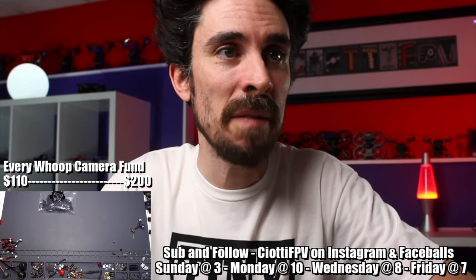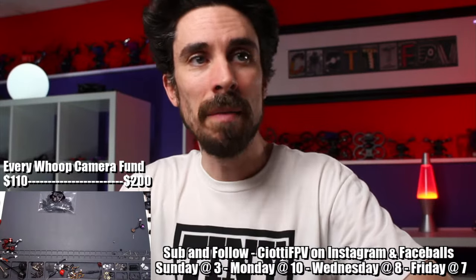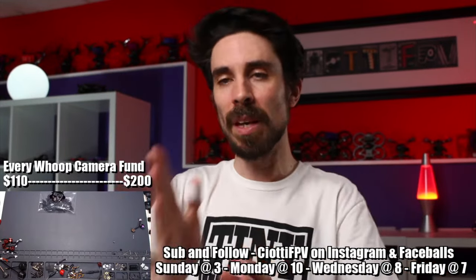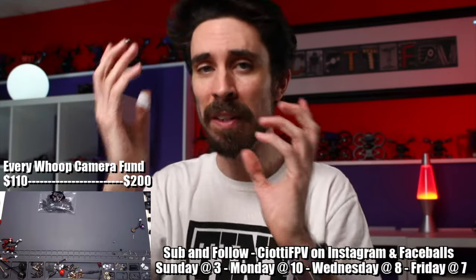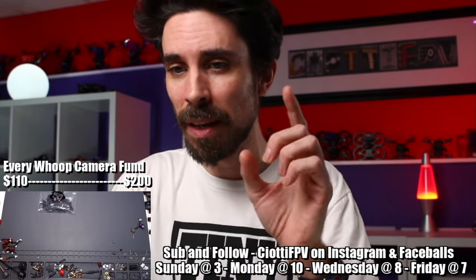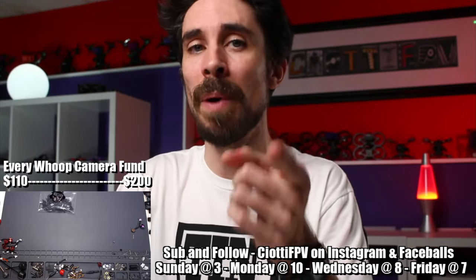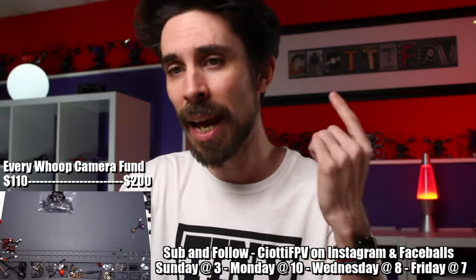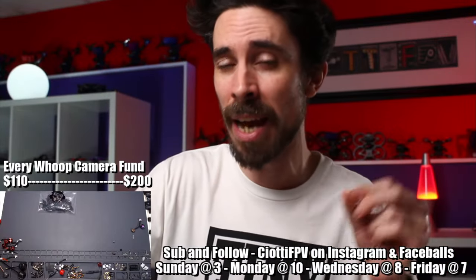Greenhorn FPV says, do you have a dummies guide to slider tuning? I don't, but basically the top two sliders are the most important ones. Run your rig as it is out of the box, completely stock. If it's not good enough for you and you care about what your flight footage looks like, I say that because a stock PID tune is going to make you a better pilot. Because with a stock PID tune, there is going to be prop wash, and there are going to be weird little things that happen when you put the rig into dirty air.